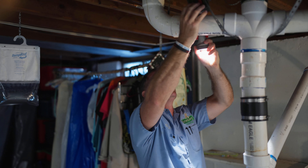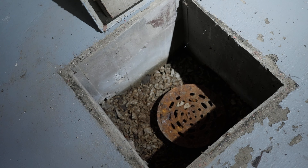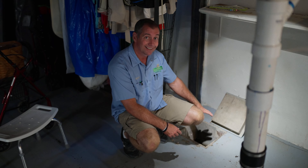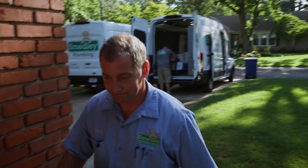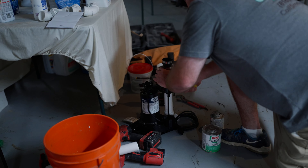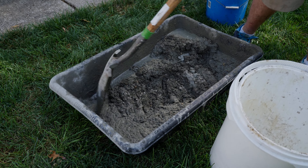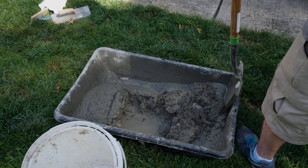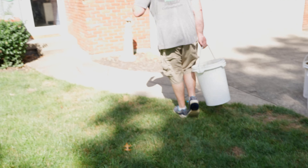This particular home has this square box in the floor called an interior foundation drain pit. There is a floor drain hiding in the bottom of this box, and all of the groundwater from around the home is brought to this area through weeping tiles and dumped into the floor drain. During heavy rain events, all of that groundwater gets directed into the sanitary sewer, which is not designed to handle that volume. When you add 10,000 houses in the area all with these pits, it adds up really fast — we're talking hundreds of thousands of gallons of water very quickly.